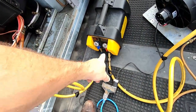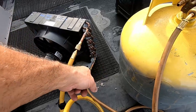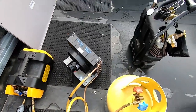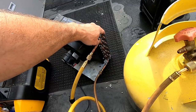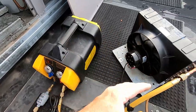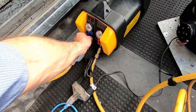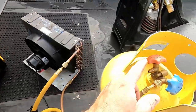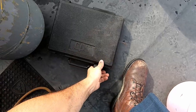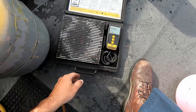We're going into the top of the radiator/condenser with the fan running, coming out of the bottom hopefully as liquid, with the schrader core depressor removed, going into the tank. When we're finished, keep in mind it's usually 0.6 ounces per foot - I end up with about almost a pound of refrigerant this thing's going to hold. I put a ball valve on the end of my 3/8 hose - when I've got as much out as I can get and it's down to zero, I'll valve it off, unhook it, hook onto the input side and use a straight hose to the tank to recover what's left. This unit holds 45 pounds and the tank's maximum capacity I believe is 47.